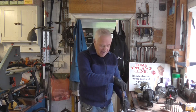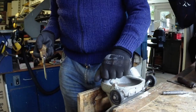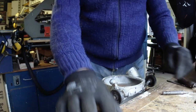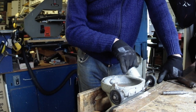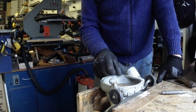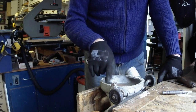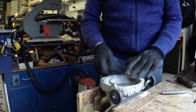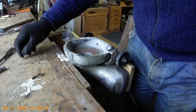That's one done. For the other side where there's a bolt stub sticking up, all you've got to do is file down the head that's showing until it's flush with the surface, then drill it like I did this one. Don't try drilling it with a stub sticking out because the drill will go all over the place. You get the idea — it is possible to drill the bolt out.